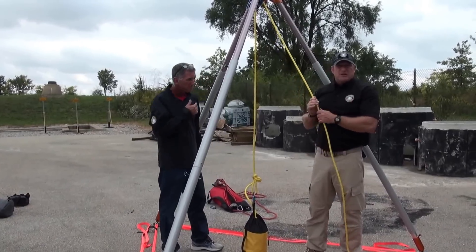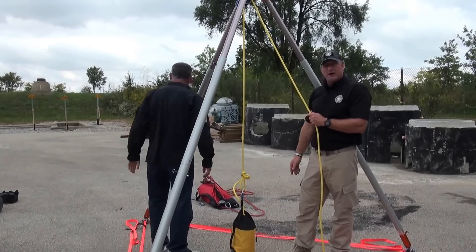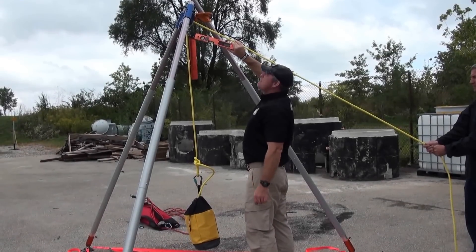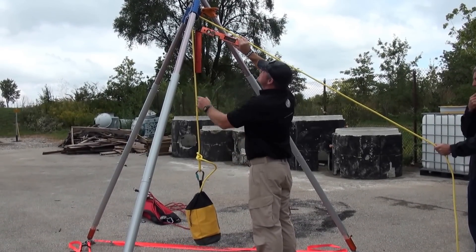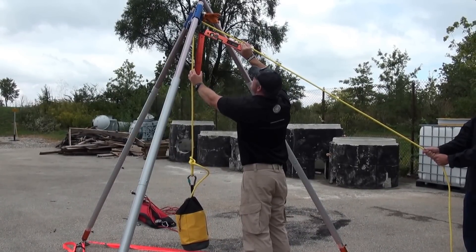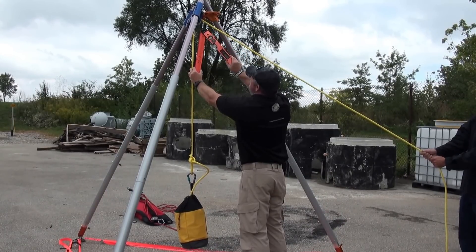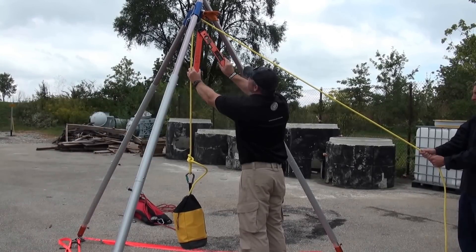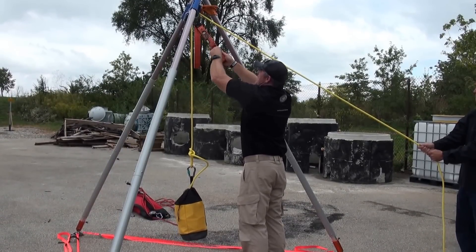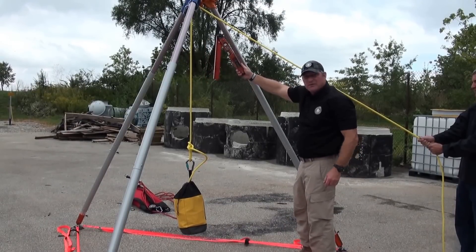In its simplest explanation, that's the basic premise of resultant force. We're going to use a digital slope finder to illustrate this so everybody can see it. So with our digital slope finder in place, you can see right here — with the angle we've created, we're at about 70 degrees. So if I'm going to find the bisecting point of this, I'm going to move this until I'm at about 35 degrees. And as soon as I'm at 35 degrees, this plane would create a point. Wherever that point hits the ground, if it's inside of the footprint, I'm relatively stable.